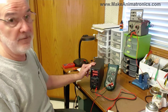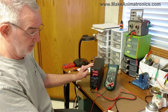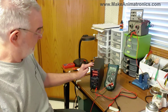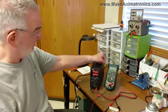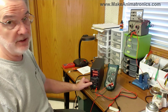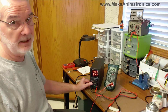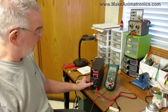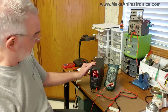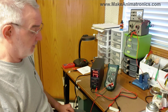I've set the power supply to 5 volts and 5 amps, and put a meter across a 10 ohm resistor connected to the power supply. Right now the power supply says 5 amps, 5 volts, and the meter says no voltage — because of the beautiful output button feature that lets you turn the output on and off without disconnecting leads. When I turn on the output button, I've got 4.97 volts and almost 500 milliamps going through the resistor.